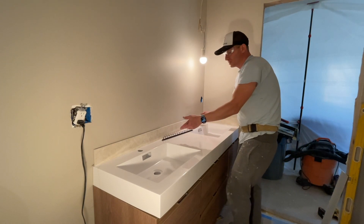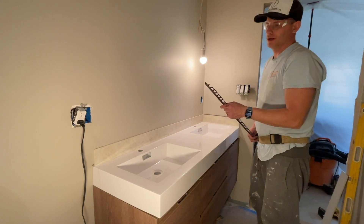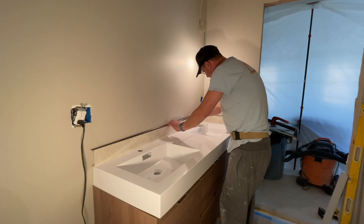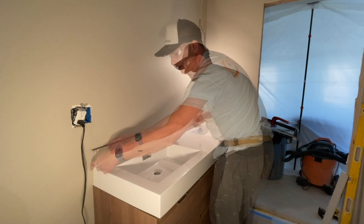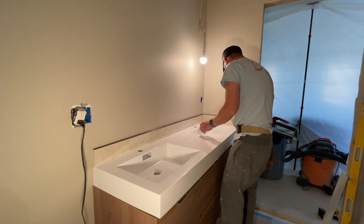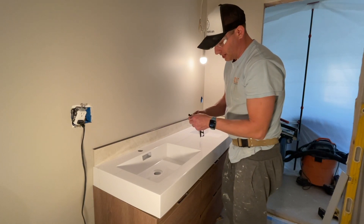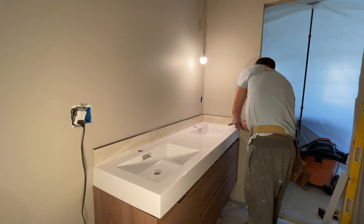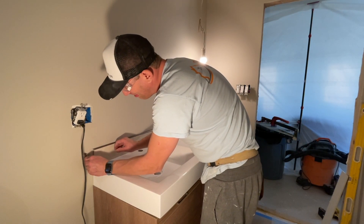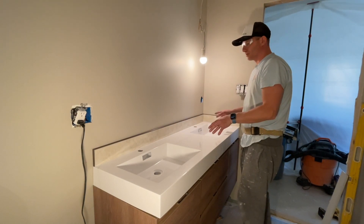I'm going to slide that in there like so. It's looking really good. Let's finish it off with a Schluter Jolly. There are a few ways to do an edge on the Jollies coming down. I like doing a clean 45-degree cut. I know some people bend it, but as the carpenter in me feels — let me 45 it with my miter saw. That's not really a tile guy thing; some tile guys like bending it. I think it's okay, but I'm not crazy about it. I feel like you could waste a bunch of Jollies that way. So what I do is I just 45 the corners. Get this one on — looks really good. And then get this one on — also looks really good. I'm going to mortar this up. Once it mortars up, I can silicone everything. So let me start working on mortaring it up.